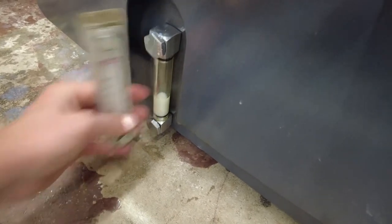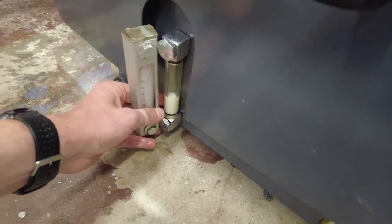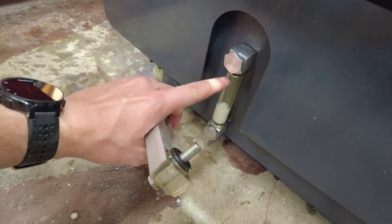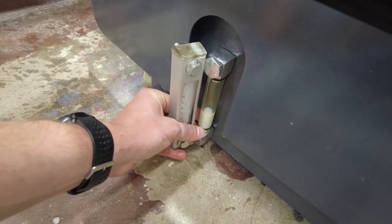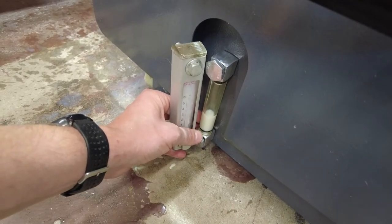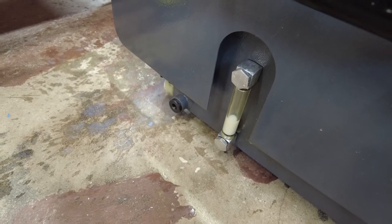I want to compare and see exactly what level I'm shooting for because the old one has gallon markings. If I put it up against there, it looks like at six gallons I may be right here. I definitely don't want to fill this thing all the way to that top O-ring. I might mark this with a sharpie once I get a good level figured out, but I'll probably fill it until it's about three-quarters of an inch from the top. I should also mention the coolant left in there was probably really rich — probably a lot higher than 8% — so I'm probably sitting above 8% now. I'll run a little lean on the next bucket and fine-tune that.